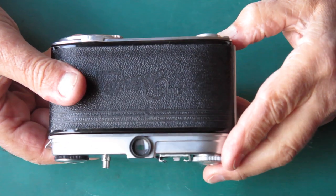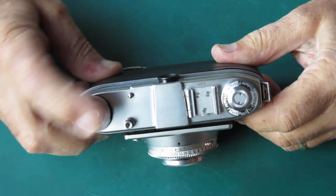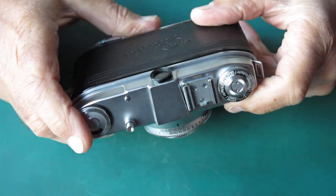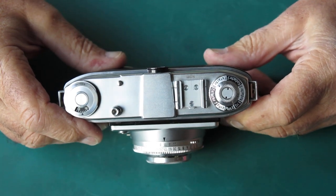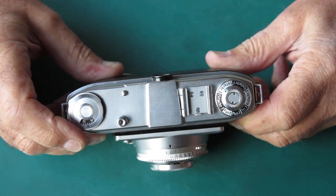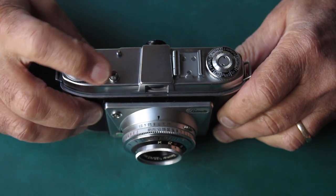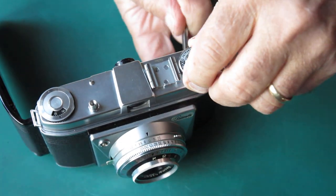Well, it's the first day back after my summer holiday, and I have the Retinette with the mystery film release button problem here. As described by the owner, the film release button is sitting low, goes down with the shutter release button, and does not function to release the film advance. Now, I was quite sure that the film release button was sitting incorrectly placed — basically that the shutter release plate was incorrectly placed so that this was trapped underneath. That's not the case. This is clearly below the head of the screw on the top of the film release shaft. That's weird. I don't know how it got there. So let's be in and have a look.